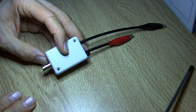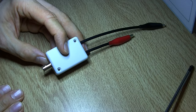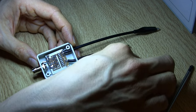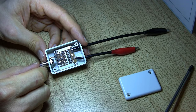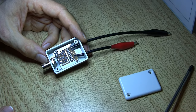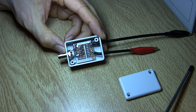When I've got this BNC on here with an exposed collar, I'll put a piece of black tape around it or slide a piece of heat shrink over that BNC connector so it's absolutely safe in tight environments. These are handy boxes made by Hammond — I bought these many many years ago. They're really cheap, about a dollar fifty or so, and they're great little boxes for projects like this.